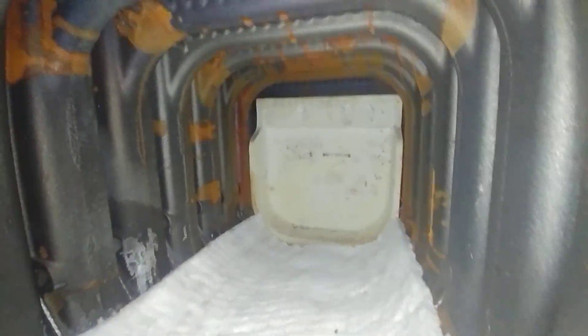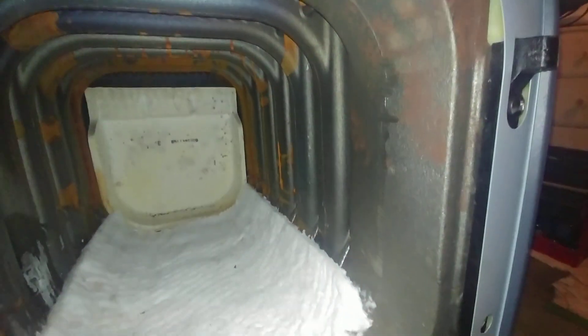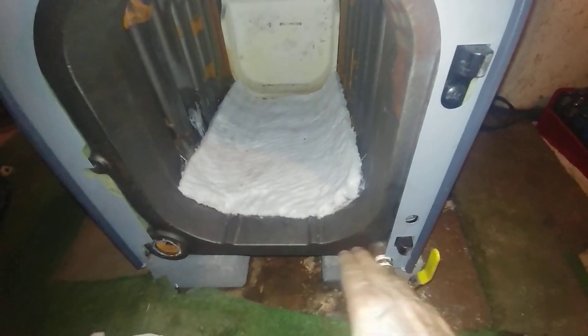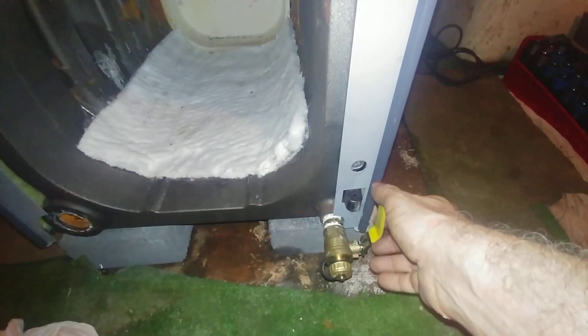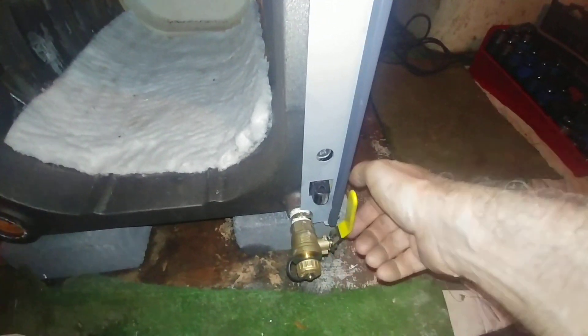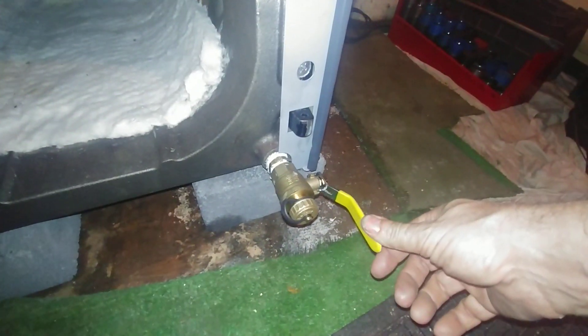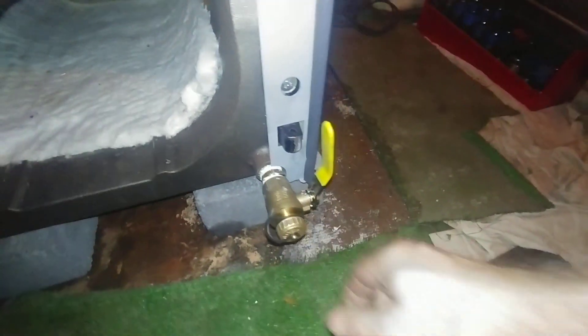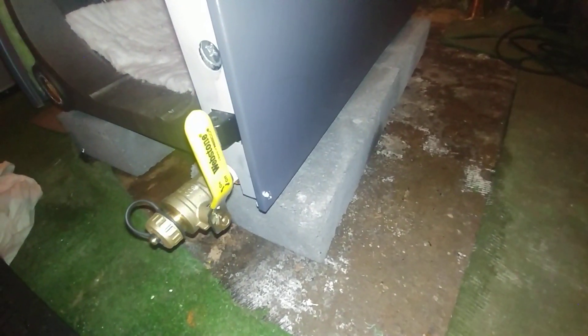There's the target wall in the back, and there are the pins going up through there. This is going to be oil-fired for heat transfer. The door gets mounted here. This is our full port ball valve that we mount here with an adapter — it's a Webstone, really nice with a reversible handle.